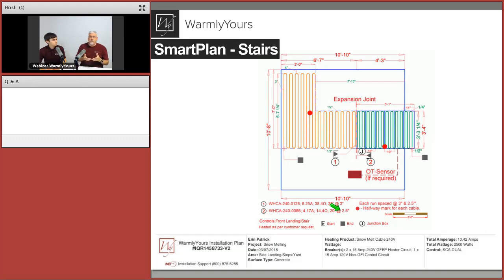The thing you keep in mind there is if you have a suspended concrete stairway, you'll see those in a lot of stoops in Chicago, where there's actually a door below, the stairs go out over the door that's below and then go down in front, and that's like a hollow area there. Wherever cold air can get at it, it's hard enough to keep something melted with just the air on top, but now you have cold air on top and cold air going in from that hollow bottom. That requires even more electricity, more BTUs, because now not only do you have heat loss coming out of the top of the stairs or the walkway, you now have heat loss going out the bottom because it's just open air down here.